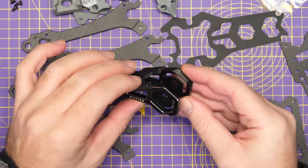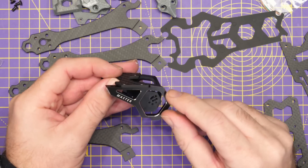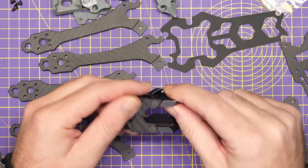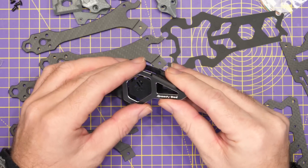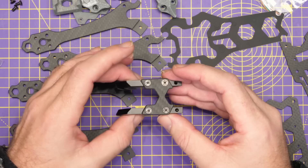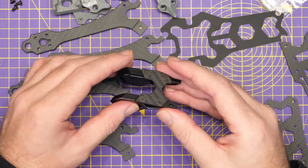Just something I wanted to show you here on the front CNC area: you've got these little camera plates mounted on either side — I think they're plastic. When you install them, they include these little rubber pieces that go behind them. They are basically 0.5mm tall and what they do is set the width of the camera area, so whether it be 19mm or 20mm for the DJI camera. They're also going to offer a little bit of vibration isolation which may help with the O3 camera — you can put the O3 camera in with them in place, but they're specifically designed to set the width.